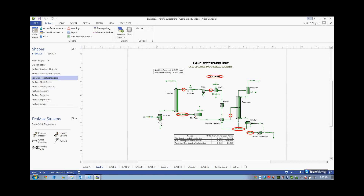This gas is going to proceed through a knockout drum to the contactor. In the contactor, it's going to be contacted with an amine solvent. Through this column, there are going to be various chemical reactions that take place that will remove H2S and CO2 and give you a sweet gas. This sweet gas, as you can see, is less than 1 ppm H2S and roughly 5 ppm CO2, which is a significant reduction from the 6% and 7% we initially started with.